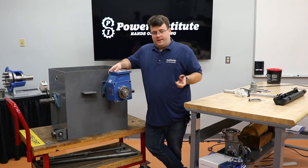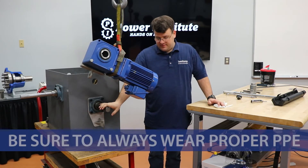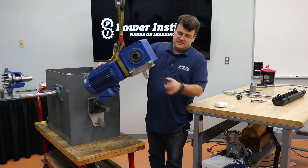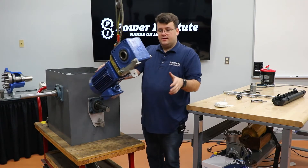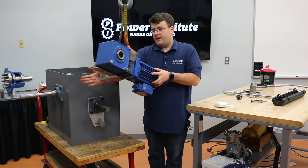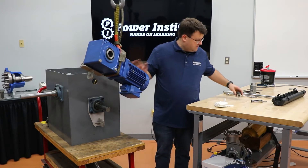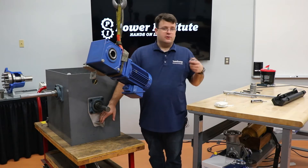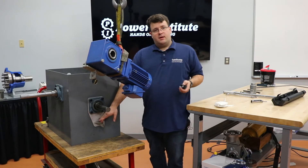Next we'll go on to a keyed hollow bore Hyponic. So we're going to do a Hyponic with a keyed hollow bore. This is our Hyponic product here, ready to go onto our shaft. Keyed hollow bore — this is common for all keyed hollow bore products, but we'll show on the Hyponic. Just to show our torque arm: this is a T-type style torque arm for the Hyponic. It comes with the hardware to bolt it to the reducer in whichever orientation you want. Make sure these are nice and tight before you go to mount it, lock washers and everything. For this we're having the torque arm on the back. The hardware that comes with it is two rubber bushings and two flat washers. The bolt length is dependent on how thick the material you're bolting to — we give some recommendations in our O&M for diameter of the bolt, but the length will depend on what you're bolting it to.